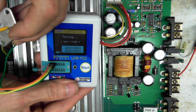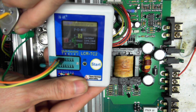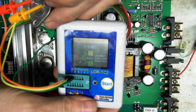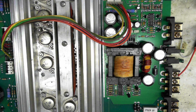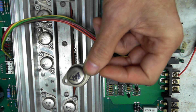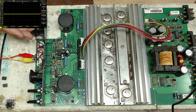Can anyone tell me what a PD MOSFET is? The other transistors don't come up as a PD MOSFET — I'd have to look up what the 'D' stands for. But it definitely was not functioning the way it should. This amplifier will run without that transistor in place. These are expensive and hard to find.